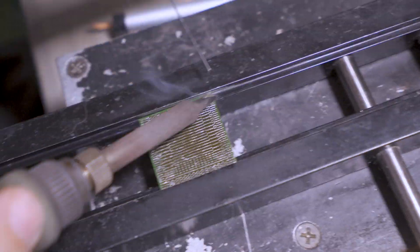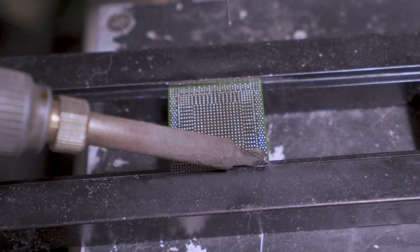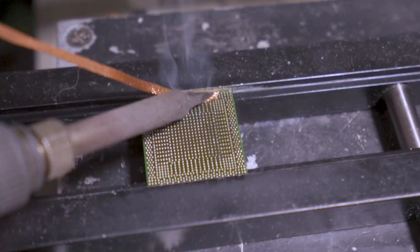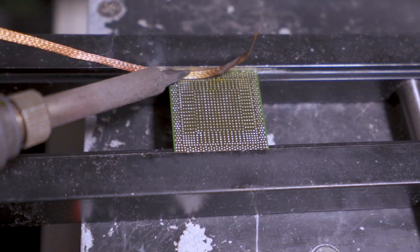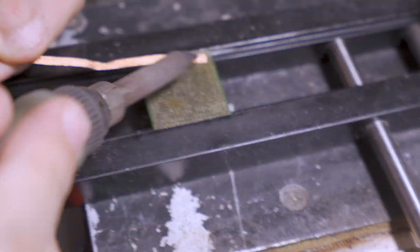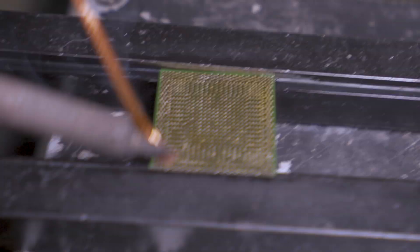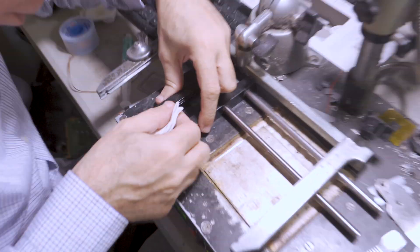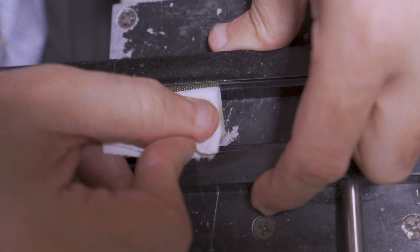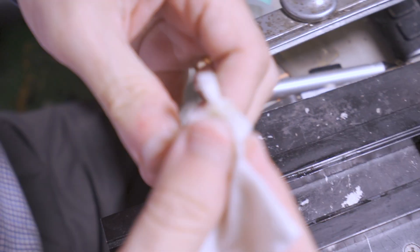Just like the motherboard, we start by fixing all the soldering pads on the GPU chip. When we're done with that, we remove all the old solder. Then we clean it thoroughly and make sure it's very clean and ready for the next step, which is the reballing itself.